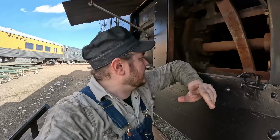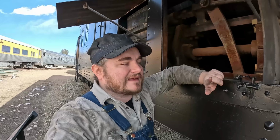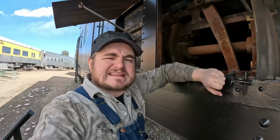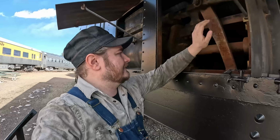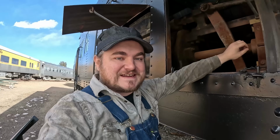One thing that's worth noting when we're talking about the rotary plows like this, in some parts of the world they did run themselves, but most of the ones in the United States weren't self-propelled. This engine is just to spin the wheel of death, and you'd have to shove on the back of this thing with more locomotives to actually ram it into the snowbanks, making true rotary operations quite the interesting thing.